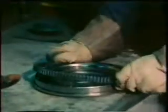Making use of thermal expansion again, and again in connection with the motor car. This toothed ring is the ring gear which fits around the flywheel of a car engine — it engages with the starter motor when you switch on the engine. It's accurately made to be completely circular, like the flywheel, but it's just a bit too small to fit. So it's heated up. After some time it has expanded uniformly, because it's accurately machined. Now it should just fit onto the flywheel — and it does. As it cools, it will contract and grip the flywheel so tightly that it will have to be machined off if it has to be replaced again.